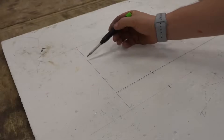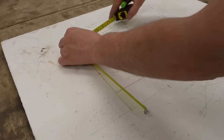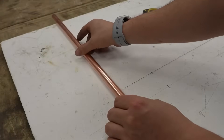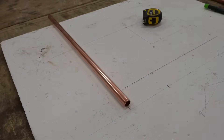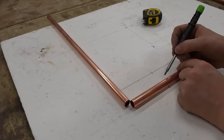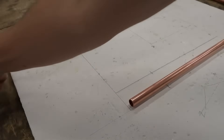I'm also going to cut this pipe section up here. I'm going to give that a rough measurement as I want a straight piece of pipe for reference, so I'm going to go 450mm. Now I have a straight length of pipe, I can position it roughly where it needs to be. Then I can hover this piece up to it and get my 100mm for a starter point.